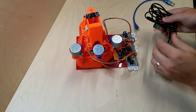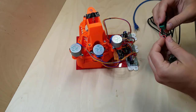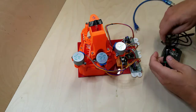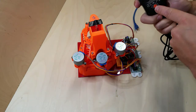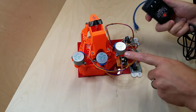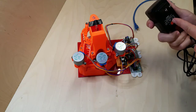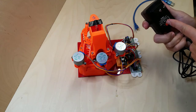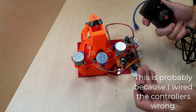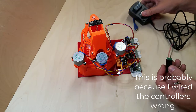So we need two power sources, one for the motors to keep them isolated from the power for the Raspberry Pi. So I found this power supply, which I like quite a bit, and it lets you set the voltage. And so I've set it to 7.5. Even though these are 5-volt motors, I found during auto calibration that they couldn't turn these motors at all at 5. At 6 and up to 7.5, there is a little bit of struggle. But 7.5 seems to be the least amount of voltage you need to provide for it.